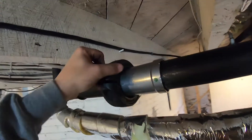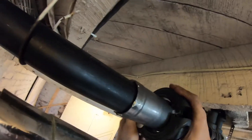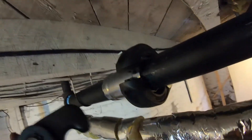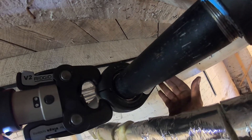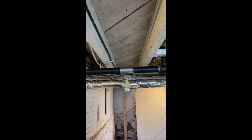As soon as it's done pressing, put the tool down, move the ring over to the next link, make sure it's nice and straight, get it in a position where you're going to be able to get those jaws on, make sure you line it up, grab the tool, put it on the indents, make sure it's straight, and pull the trigger. Take the ring off — and there it is: a pressed joint.